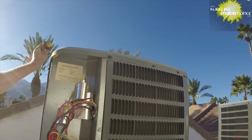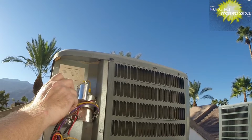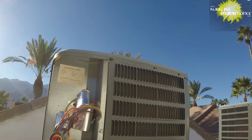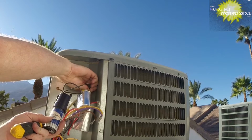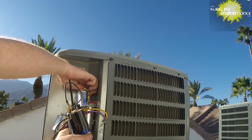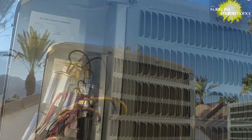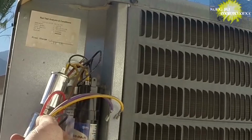That one there. We can put the hard start kit in front. The hard start kit's gonna go one lead to Common, one lead to Herm. And I'm gonna put the lead that has the double wire on the side there. Oh, this one, both sides have a double, so that's good. There's that. At least now our capacitor doesn't move around in this position, so that's good.